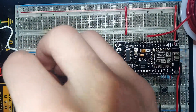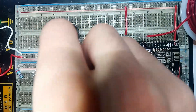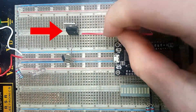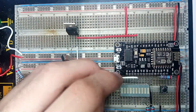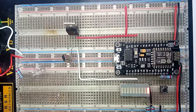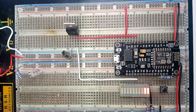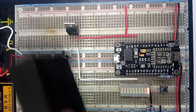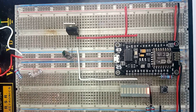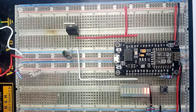I incorporated the LED experiment with this sensor, adding a new input pin for the phototransistor's signal pin. I rewrote the code so that instead of a half-second delay, the microcontroller waits for the light beam to be broken. There's also a MOSFET converting the 5V sensor signal to 3.3V for the microcontroller and boosting the weak receiver signal. But things stopped working — it lights the second LED not when I break the light beam, but when it's recreated. And for very short blockages, it simply refused to register. With all these shortcomings, I decided to buy the correct IR receivers. I'll have them ready for next week when I'll also design a barrel to mount the coils and sensors.